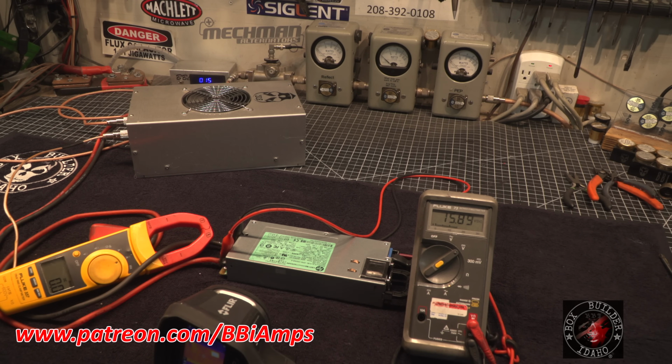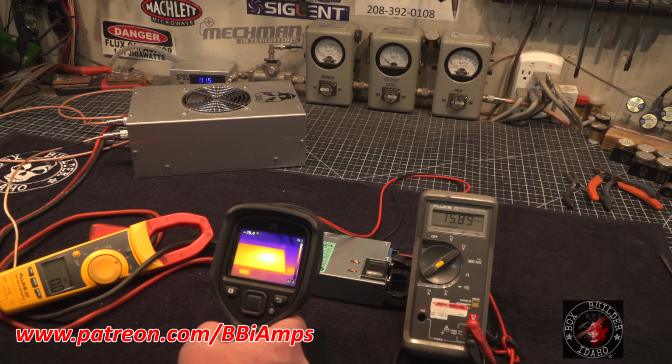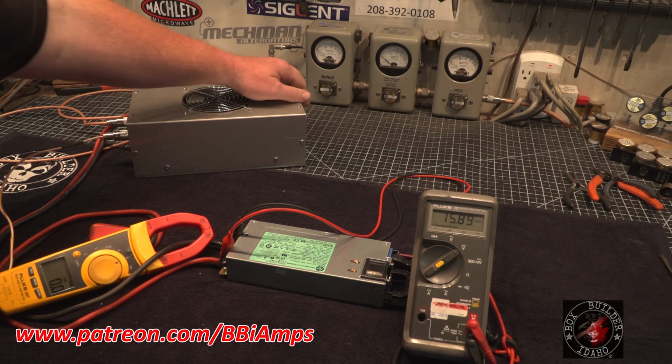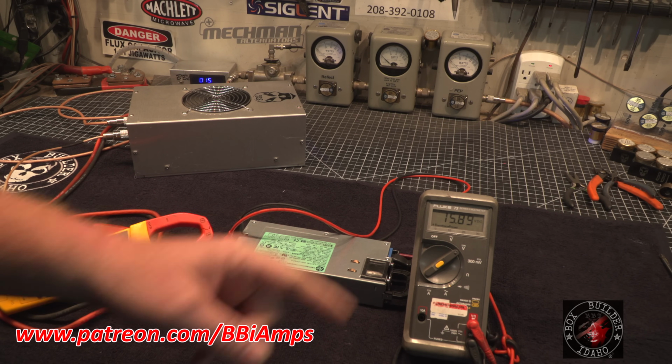Okay. I don't need to mess around with that anymore. Let's do a baseline measurement. Power supply at idle is producing 78 degrees of temperature. Everybody can see that. 78. 15.89. Over here we have our amp gauge floating at 1/10 of an amp. So we'll go ahead and apply our fan and our LED. So we're seeing 3/10 of an amp worth of load on the supply.